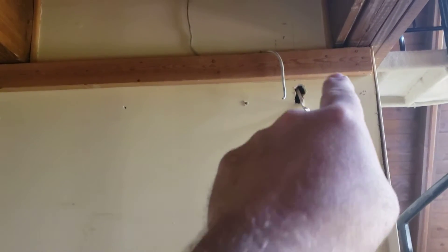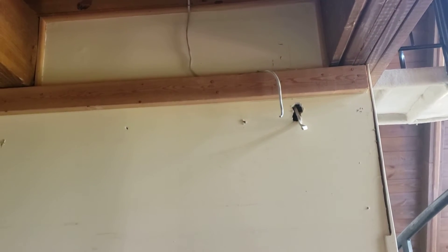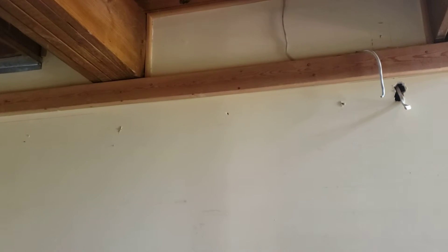The ceiling line on the wall is 84 inches, so the board above that will need to be removed before installation. That space with the wire coming out — we need to figure out the wiring situation, whether we're doing under-cabinet lights or any wiring inside the cabinets. All of that needs to be handled before we come in. Above the sink line would be a good place for a wire outlet if you want a light above the sink.